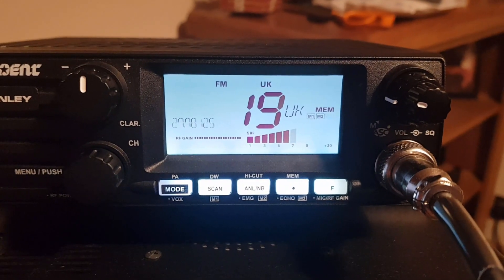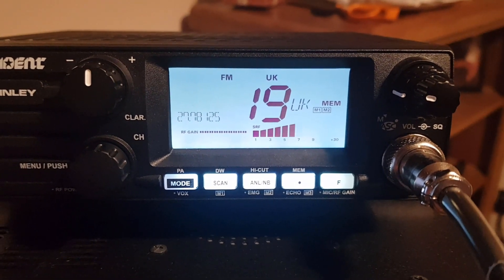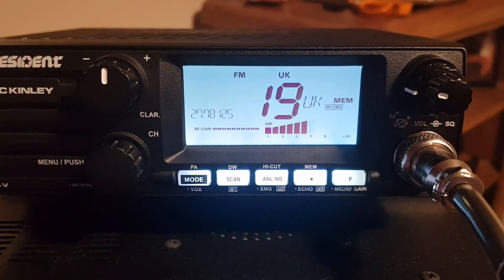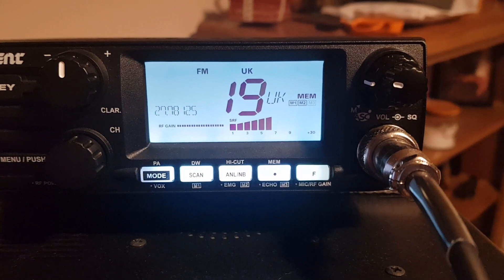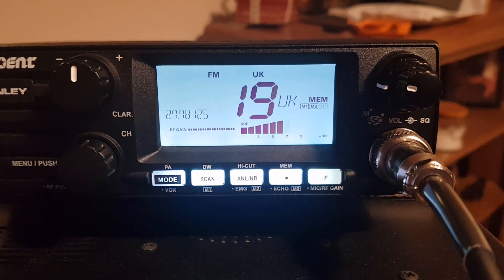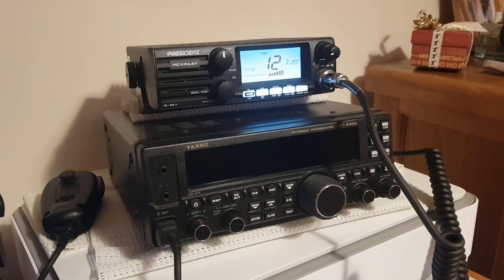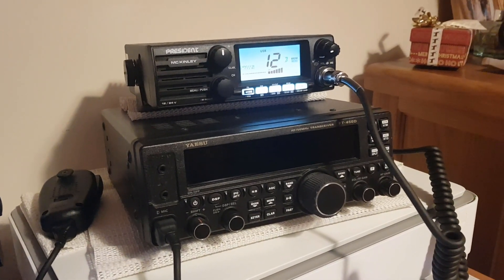On the UK legal straight 40, channel 19, we've got a flashing S7 with the antenna straight into the back of the radio. And with the RF choke installed we have an S6, so it's definitely gone down when we put that RF choke in — brilliant. So a positive outcome — the RF choke does make a difference, albeit a little.